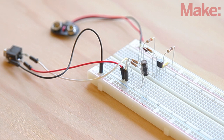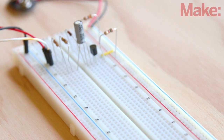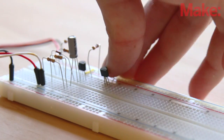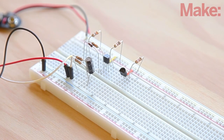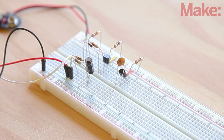Your audio input is now ready. Next, you'll build the high frequency filter. This part of the circuit works by filtering out all the low frequencies of the audio spectrum and only allowing the high frequencies to pass through and trigger the LEDs. Insert a 2N3906 transistor into the breadboard with its flat side facing forward again, and connect power to its emitter leg — the left one — with a jumper. Connect power to the base of the transistor with a 2.2-kilohm resistor. Insert the 0.47-microfarad capacitor into the board, connecting one leg to the base of the transistor and the other to an arbitrary spot on the other side of the breadboard over the trough.